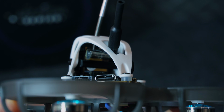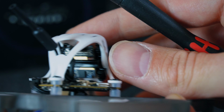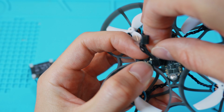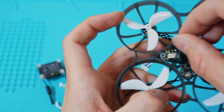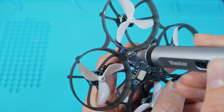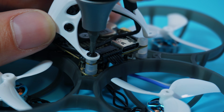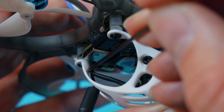And once that's gone, well, so is your video feed. Game over. At the moment, there's no replacement O4 camera you can just order. So yeah, do yourself a favor, secure that plug. Alright, moving on. We connect the air unit to the flight controller using the included cable. The whole setup's plug and play with the Matrix FC. Then we swap out these short screws for the longer ones that came with the kit.